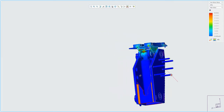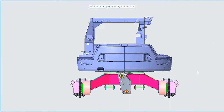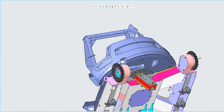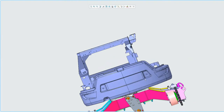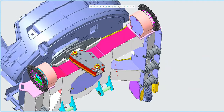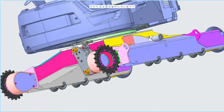Though when the brake was engaged, the backlash was fully reduced in stationary position. To optimize the current design, increasing the mounting torque or mounting the cylinder horizontally and applying force through an L-bend bracket could improve upon the shortcomings of the current design. This concept gave insight on how a braking system could be used in aspects not yet explored, demonstrating innovative and cost-effective ways backlash can potentially be reduced without resorting to an expensive gear tolerance redesign.